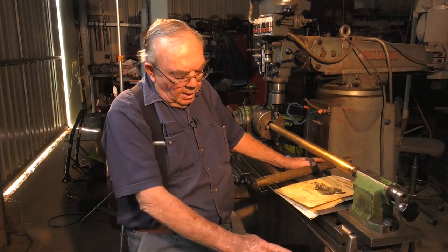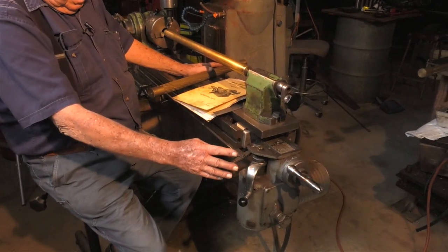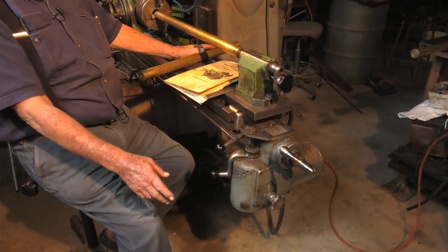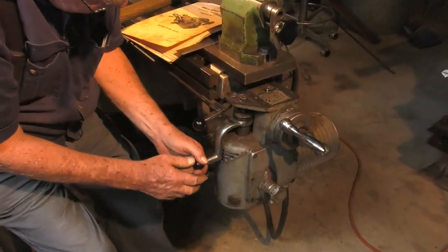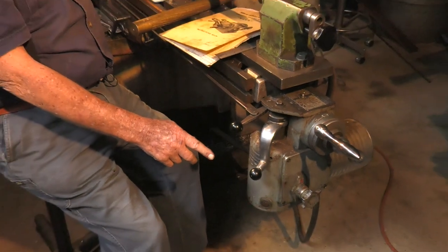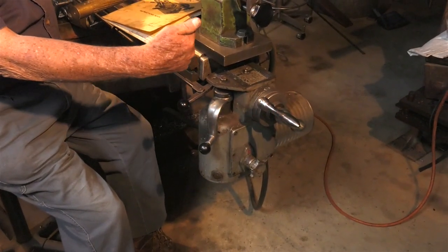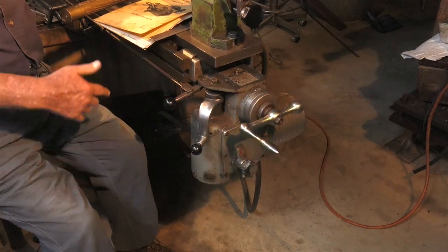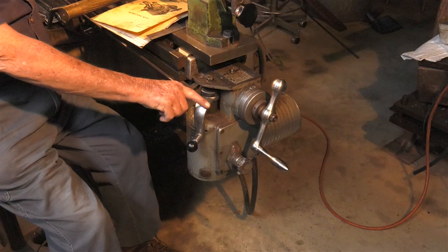It's fitted with an automatic travel attachment that goes forward or reverse, and variable speed by moving this. I suppose it's like a Norton box on a lathe. Just need to give it a bit of a nudge. Must be a bit of stage fright. Right, that's where it is. I'll demonstrate that for you without actually doing anything. I've started the motor. Then if I want it to travel in the left-hand direction, I flick the lever that way and away she goes. It'll go as far as the stop is set, or until I decide to stop it, and that's always a bit tricky to do.